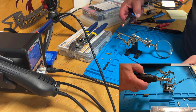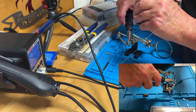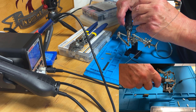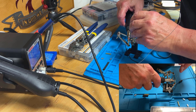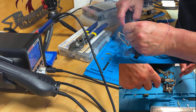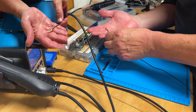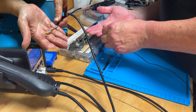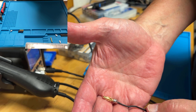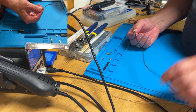What do you think? Look hot enough to you? As soon as this plug heats up, this solder wire is going to disappear like nobody's business. There we go. We can touch it now without burning ourselves, it's still a little bit warm. That worked out so much better than I anticipated. I'm actually not worried now about that shallow well on the connector. I think it's going to be just fine because that is one massive pool of solder in there for this size wire.